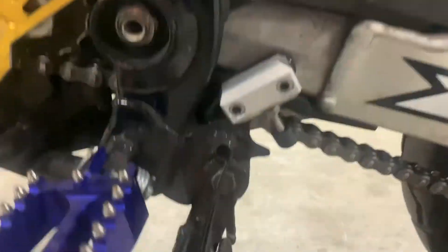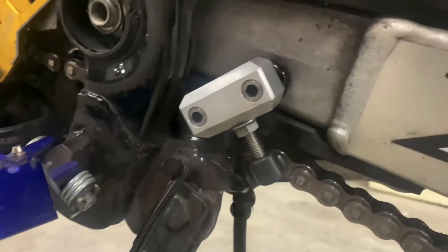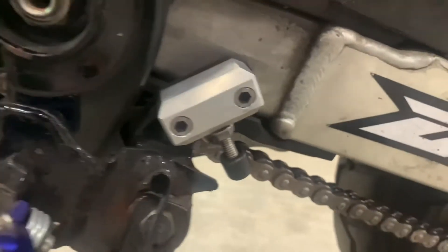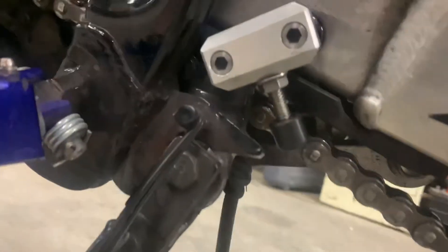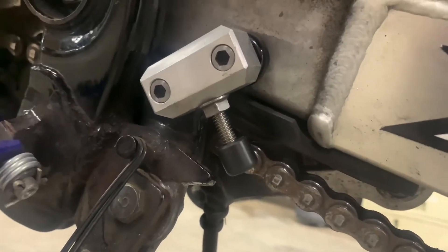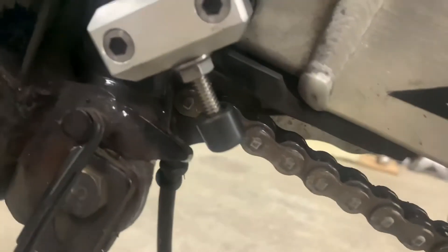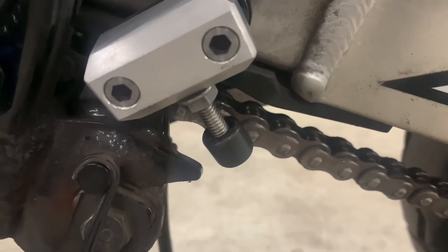I'm finished — that is the final product, V1. It's got chamfers on everything, basically, just to look nice. I grained it with some sandpaper. It has a 1/4-20 jam nut, a threaded rod, and a piece of Delrin that I just tapped with a 1/4-20 tap.